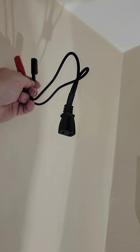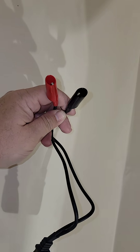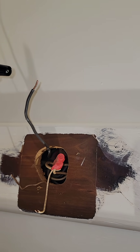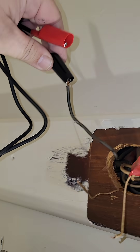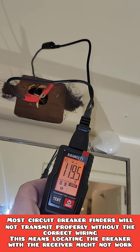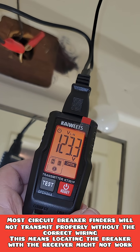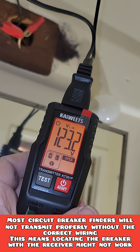I can verify over in the corner that all the copper ground wires are connected together, so chances are the ground was loose on this light fixture. Anytime you encounter open wires without any sort of plug-in receptacle or light fixture hooked to them, you can use this adapter to plug in your tester. Take the black alligator clamp and clamp it to the black wire or hot wire, then take the red alligator clamp and clamp it to the white or neutral wire. Plug the tester into the adapter, turn on the switch, and you can read the voltage or see if it's hooked up properly.